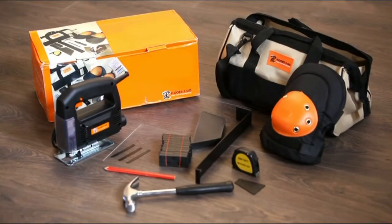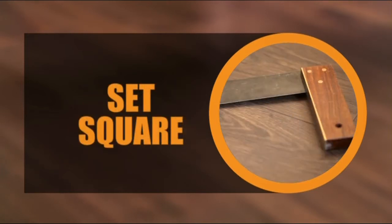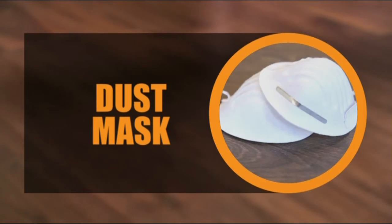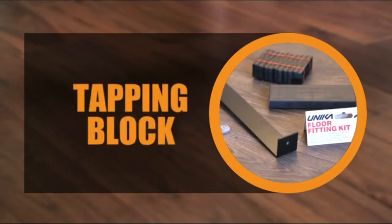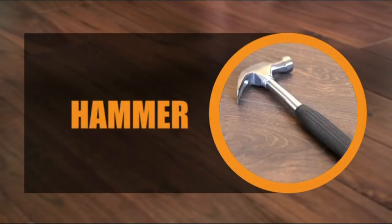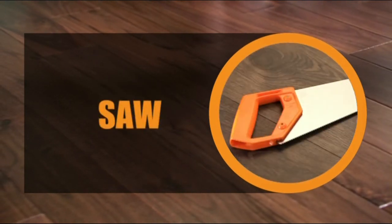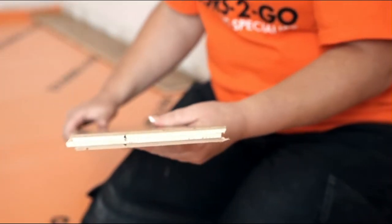To lay your flooring, you're going to need some basic tools. A Floors to Go fitting kit has all you need to lay your flooring. Otherwise, you'll need a pencil, a tape measure, safety goggles, a set square, tension straps, wood glue, a dust mask, spacers, knee pads, a pull bar, a tapping block, a hammer, a drill, wooden drill bits, and either a saw or a jigsaw, depending on how you're going to cut the flooring. Right, we're good to go, so let's start fitting.